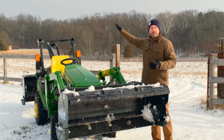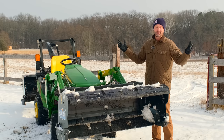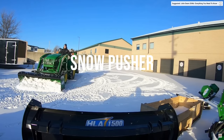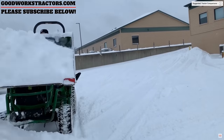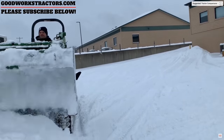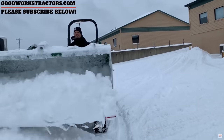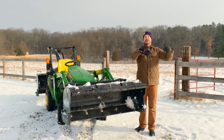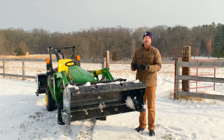We do have an option for a pull-type snowblower back there, or you can get a traditional rear-facing snowblower — every tractor out there these days has a three-point hitch and a rear PTO. We've even compared these against buckets themselves, and there are a lot of pros and cons either way. Obviously you already have a bucket so that's undoubtedly cheaper, but a lot of folks start out with a bucket and realize it's just not the right tool. With a pusher you just kind of push that pile where you want, lift the loader up a little bit, and it stays right in place. With a bucket, every single pass you're pushing it forward, you have to raise it up, rock it out, shake all that snow out, and then reset it down and repeat the process. So there's just a huge efficiency difference between a bucket and a pusher.